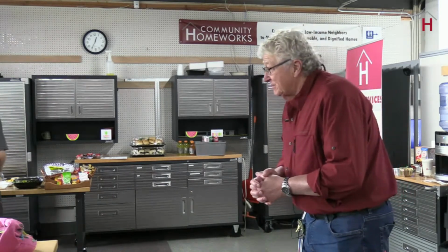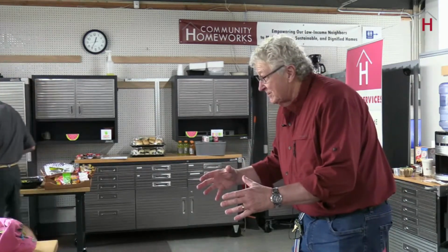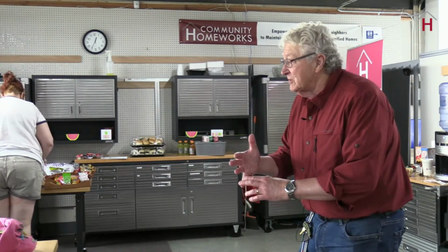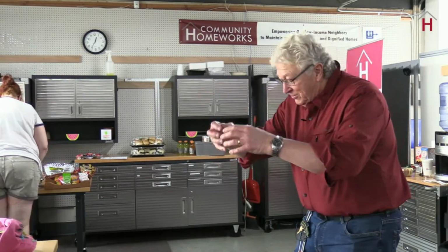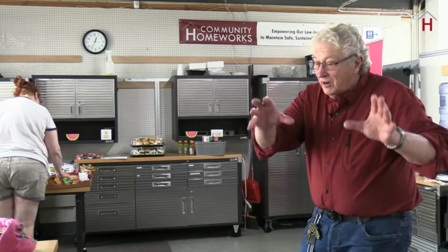I can understand that. Do you know how a dehumidifier works? It's a mini air conditioner, is what it is. Mr. Carrier, the guy who invented air conditioning for the home, never designed it to cool the house. It was to remove humidity from the house, and that's how an air conditioner works. It refrigerates the air and takes the moisture out. Your dehumidifier puts it down a hose or into a bucket. If you stand outside a window air conditioner, a room air conditioner, or even a condenser, it's hot coming off of there. That's how it works, and that's exactly what's happening.